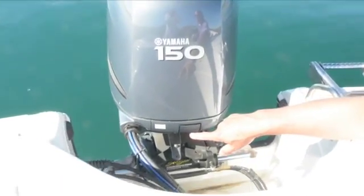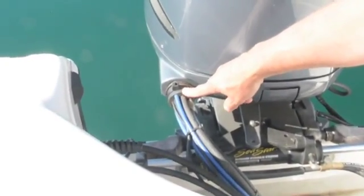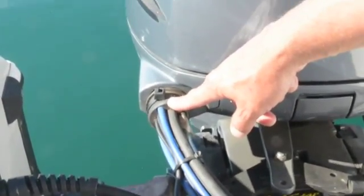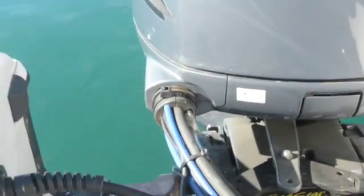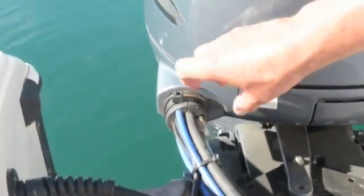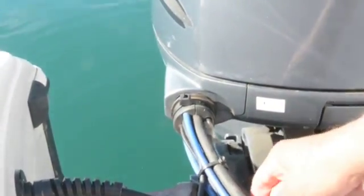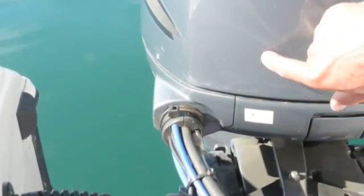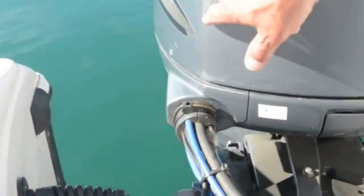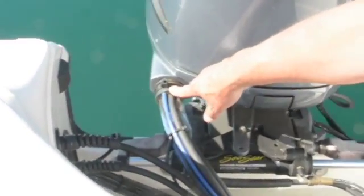Let's talk about the cable bundle. Every outboard motor has a big grommet that is designed to be taken apart and for additional cables to be included. It will either have punch-out slots or places where you can drill a hole, and it will still provide a captive cable location so that weather stays out of your outboard motor. If you take the cowling off your engine, you'll see at least one, possibly two nuts that hold a clamp on top of the grommet.